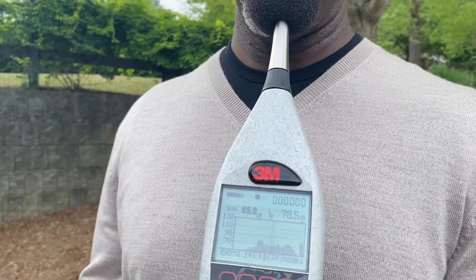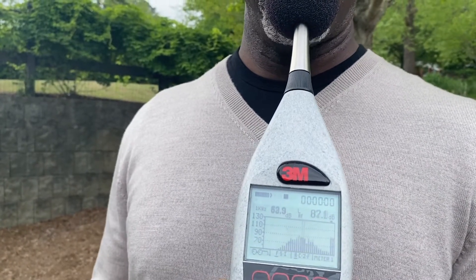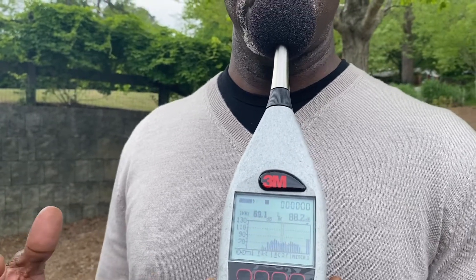If I was a piece of equipment, I would typically be looking for something that's going to be 85 dBA or greater, because that shows we may need to put that person in a hearing conservation program if they're exposed to that noise for eight hours or greater.